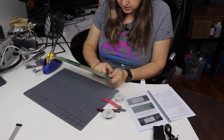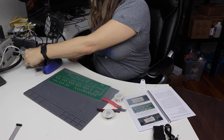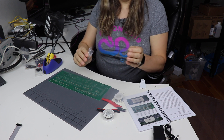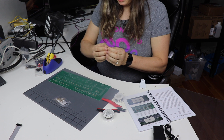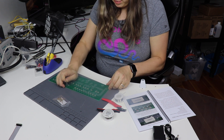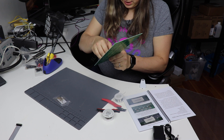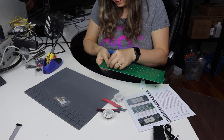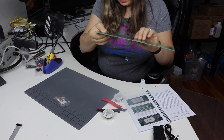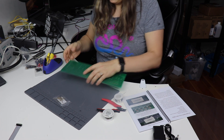These are little 1k resistors going to the LEDs so they don't burn out. Next up we have 10k resistors, which I believe are going to act as either pull-up or pull-down resistors. You may be curious about my technique — I tend to line up and do about 10 of them at a time. I grab the ends, pull up loosely, place it in the board, and bend the leads to about a 45-degree angle.